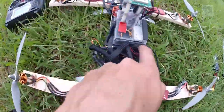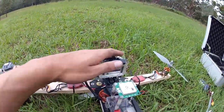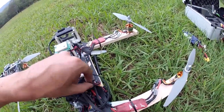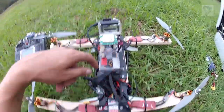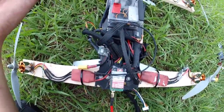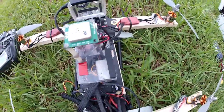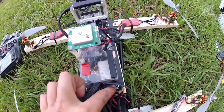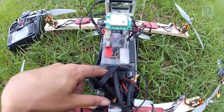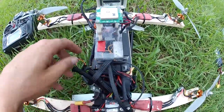I've got an on-screen display hidden away in here, which takes the video feed from my GoPro sitting in this case and runs it into the on-screen display. The telemetry information is picked up by the OSD and it's telling me direction to home, the voltage and current of my batteries, and all the sort of things you'd want to know — longitude and latitude on-screen so you can record in case you get lost. It's an extra $17 on the system, so I'd definitely grab an on-screen display if you're getting into any sort of distance flying, waypoint missions, or even FPV.